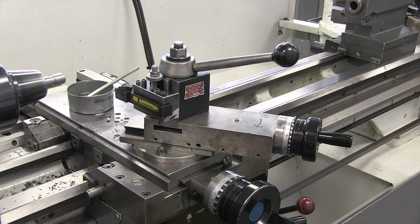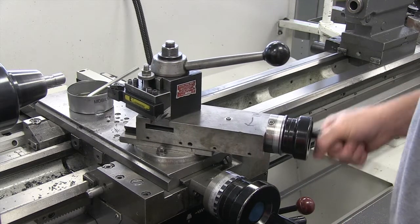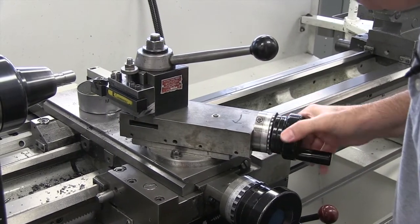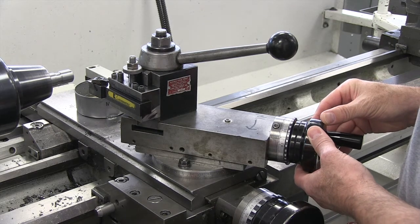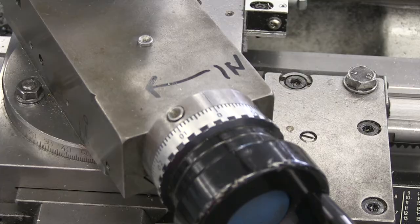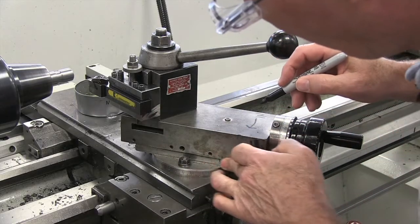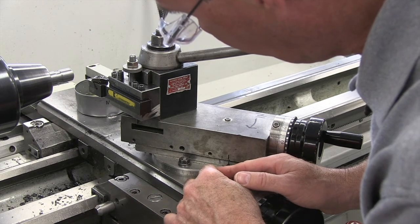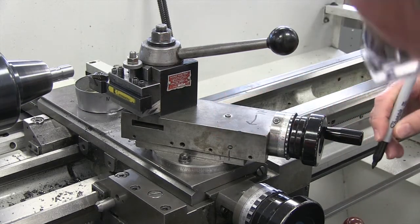Looking at number nine — adjusting the compound rest setting — right now I've got my compound rest way extended, farther out than I want it to be. I want the compound rest really in the center of its travel; it's also a little more rigid there. I'm going to come in the inward direction because I do not want any slop between the nut and the thread, also known as backlash. I've now got my compound rest set at zero. I'll put a mark here so that if at any time we forget where our zero is, we can always go back to it. This comes off easily with a little solvent later on.